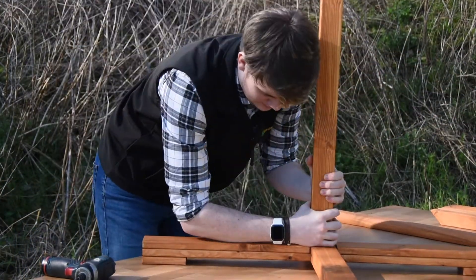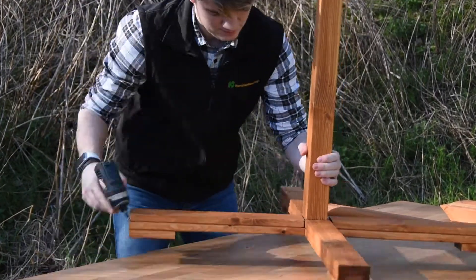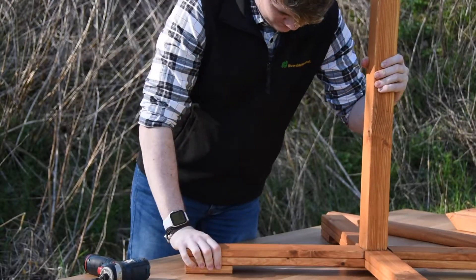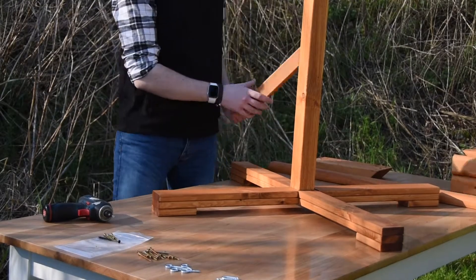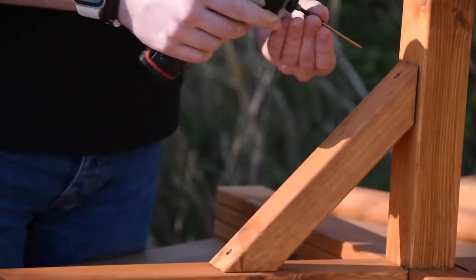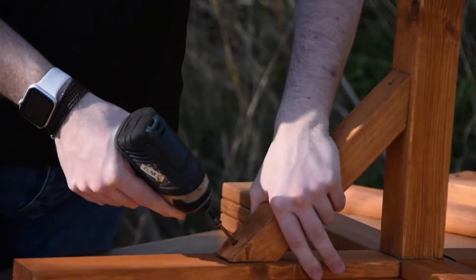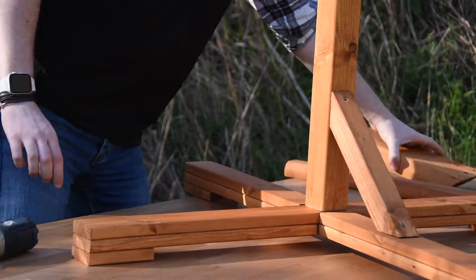Place the tip of the screw into the pre-drilled hole underneath the post. Turn that one over, centre it off using shear strength, turn it over, tighten it up again, and place it back down on a flat surface. Grab your four bottom support angles, line them up so they're nice and flat on each end, grab your 60mm screws and screw that screw in, in the top and the bottom, making sure your angle is centred. And repeat this three more times.